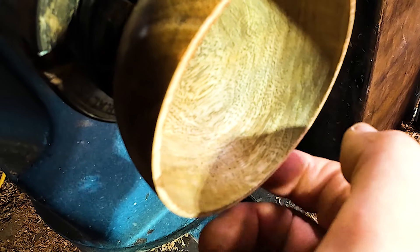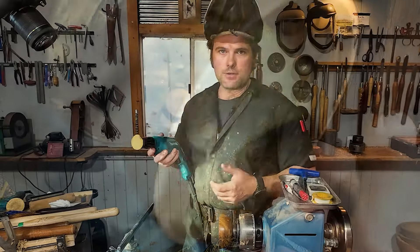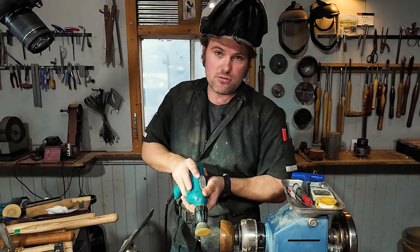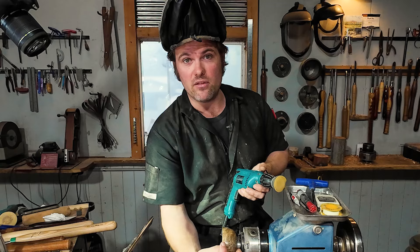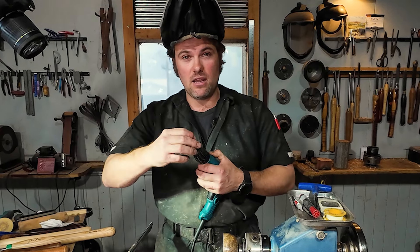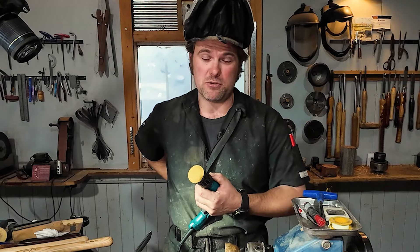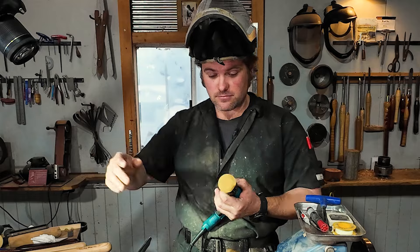As you can see, that torn grain has now been completely eliminated. By taking the torn grain out, we speed up the sanding process — you're not forever sanding one side trying to eliminate it, which in turn thins that side of the bowl, creating uneven wall thickness. You'll also wear through your drill mandrels and burn through sandpaper at a much greater rate, which all costs money.